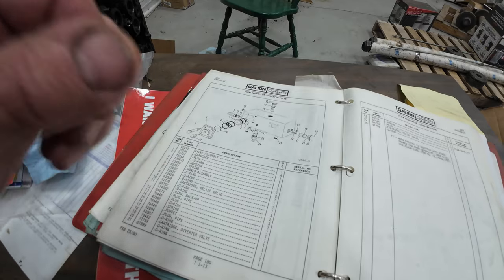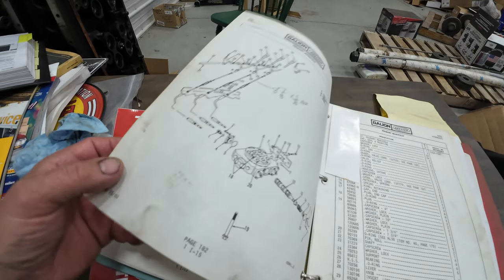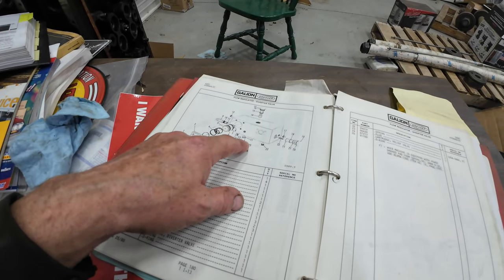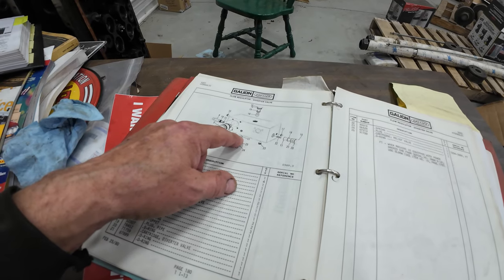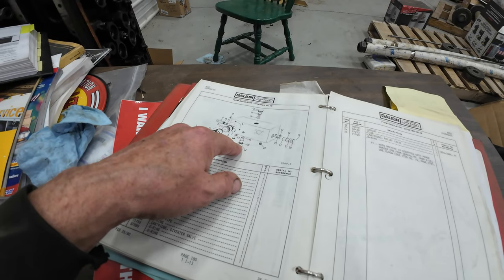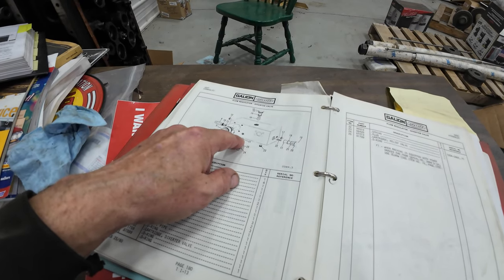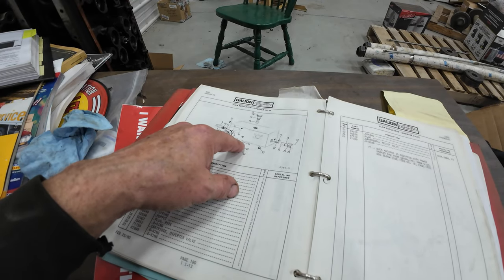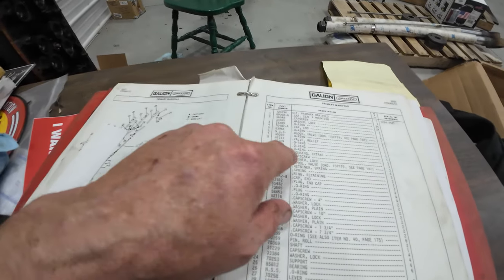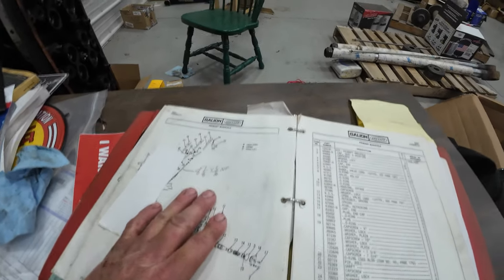And going through the part numbers, this one lists this O-ring here, which is common to this one, but they don't give you an exploded view. They just list them. And then there's one more here on the end of this. This one has a Teflon backup ring. So I took the very same cartridge out of the winch up there, and it had an O-ring is all. And the O-ring number is the very same number it calls out in this one. So it calls it a relief valve, and then it calls for these two O-rings. And this 91709 O-ring is common on all of them.